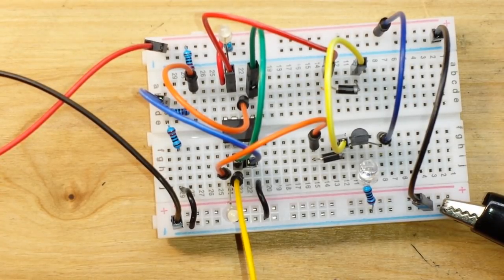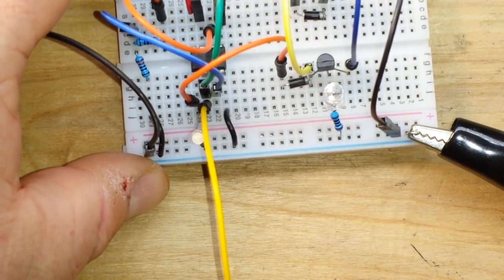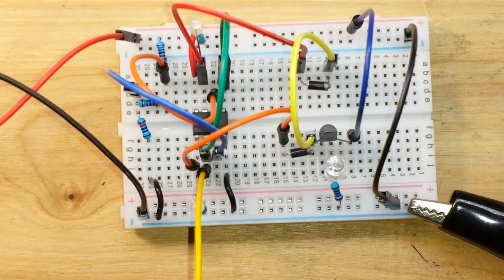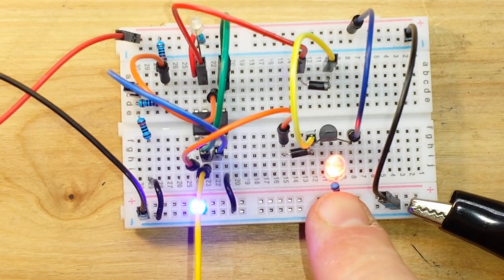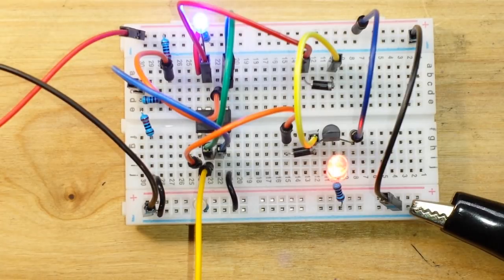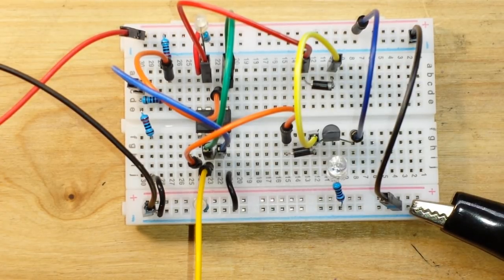Now, I have another power supply — there's the ground for it — hooked up here to our input. Right now, everything is in balance; I am applying 4 volts to the circuit. If I go low, the low voltage warning comes on, and the master alarm comes on — I'm putting in 1.9 volts now. As soon as we go above 3 volts, everything is back in balance. And then if we go above 6 volts, our high warning LED comes on, and again, our master warn comes on. Pretty simple. You could substitute a relay in here, but I just need something that is easily viewable. There is a voltage protection circuit using window comparators and two op amps.